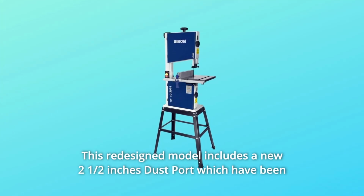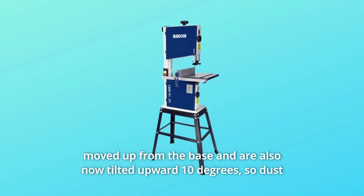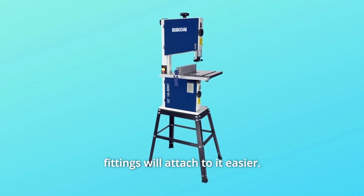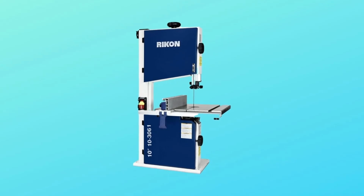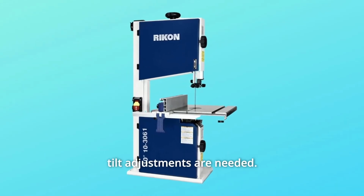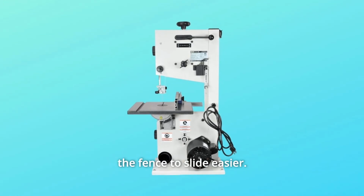This redesigned model includes a new 2 1/2 inch dust port which has been moved up from the base and is also now tilted upward 10 degrees. So dust fittings will attach to it easier. The door hinges have been redesigned to make them sturdier to avoid breakage. Fence carrier now has 4 additional plastic inserts in case fence tilt adjustments are needed. Rip fence is supplied with a plastic pad on its end to allow the fence to slide easier.